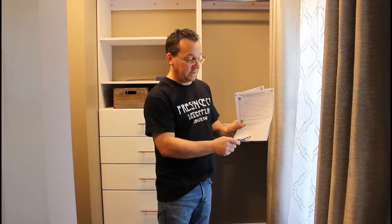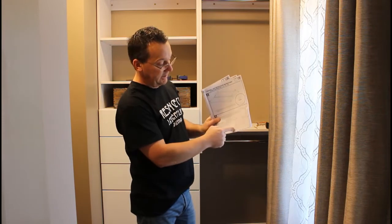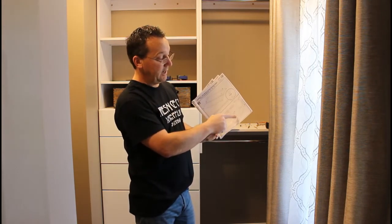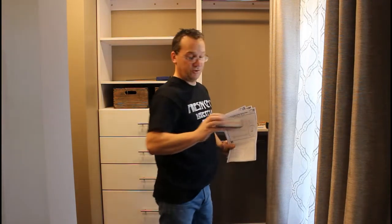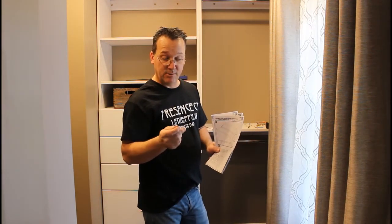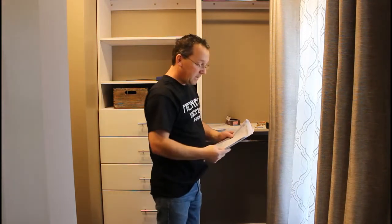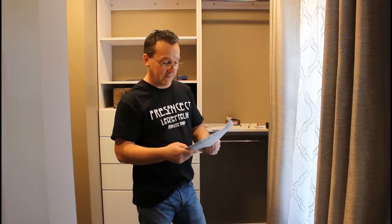When you do have to cut these and secure them together — obviously the cam nut is missing — I always pre-drill. I pre-drill a couple of holes in the side panel going into the newly cut top, bottom, and center shelf, and I use trim head square drive finish screws. They're much thinner than a sheetrock screw, so you're less apt to split the sides. I put about three on each side and it held together nice with no durability issues. It takes a couple more steps than assembling a unit you don't have to cut, but it's a very simple process overall, and because it's three-quarter inch plywood it's very forgiving.